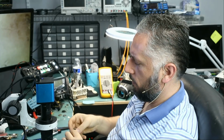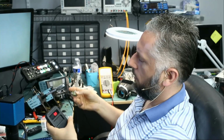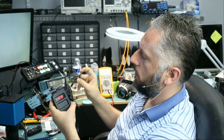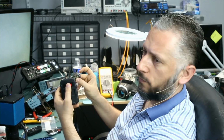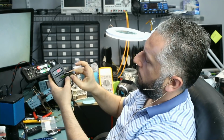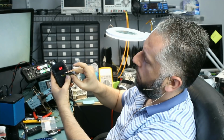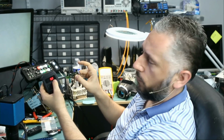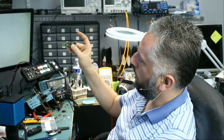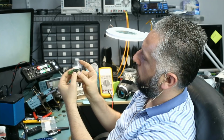Let's go ahead and test. We have a fob tester here. And if we press on any one of the buttons, the fob tester should output 314, 315 to indicate that the button is functioning properly. Right now, if we press on the button like I'm doing now, the fob tester is showing 0. It should show 314, 315. And also, when I press on any one of the buttons, we're not seeing that LED blink. It should blink red.